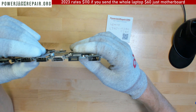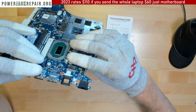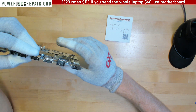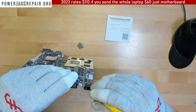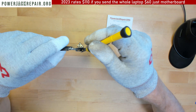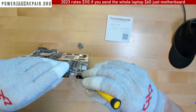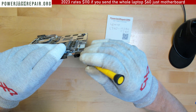Here is the center piece that's broken - you see there is no piece. And here I can see that the center pin, the center metal piece, is touching the positive ends. This is positive here, and this guy is positive. That center guy that touches the positive pins is the data signal. This is another positive.